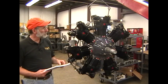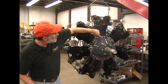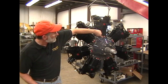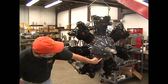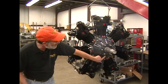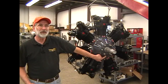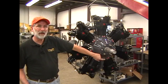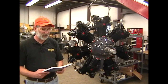Continental was a little unusual in that they embossed their serial number in big quarter-inch letters into the case. In addition, on the data plate — located below the crankshaft and above the sump — both the engine model and the serial number are again stamped. It's very important that the serial number on the case and the serial number on the data plate match.